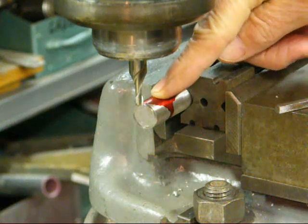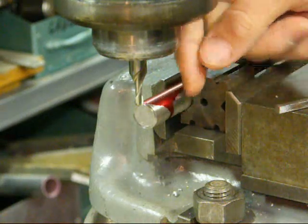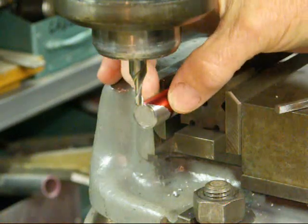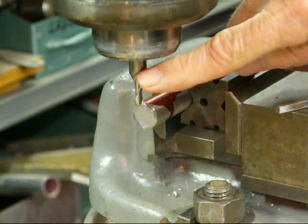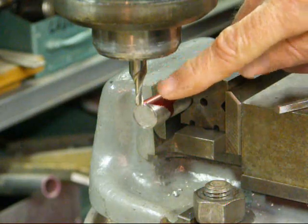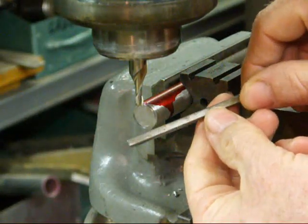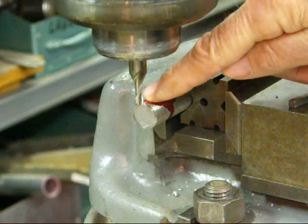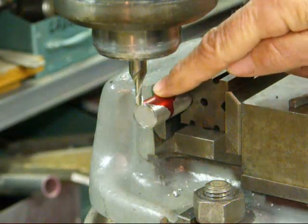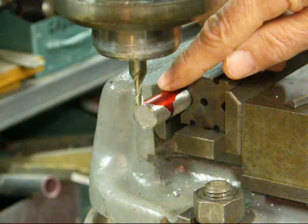If you're offset, it isn't going to line up with your sprocket or your pulley, so it's necessary to find the exact center. I've installed a 3/16 end mill — make sure it's a good sharp one on the corners, otherwise it will not give you sharp corners in the keyway and the key stock will not fit in there. I've brought the quill down until it just touches the work, set the collar on my knee to zero, and I'm going to make the cut in about three or four passes.